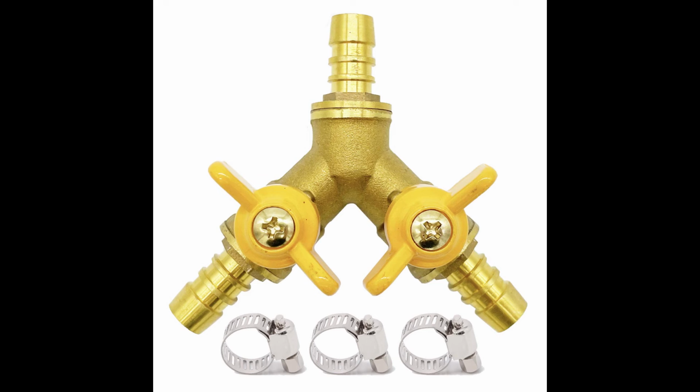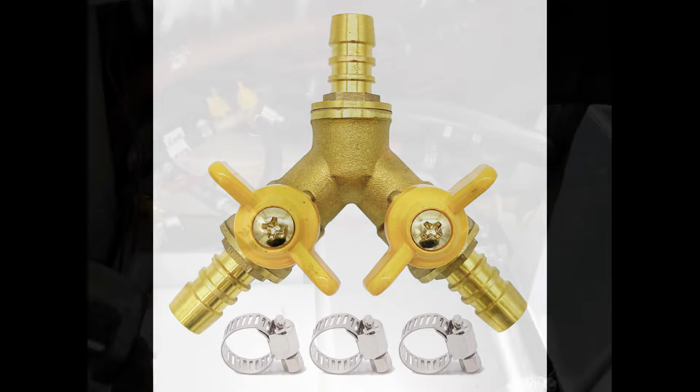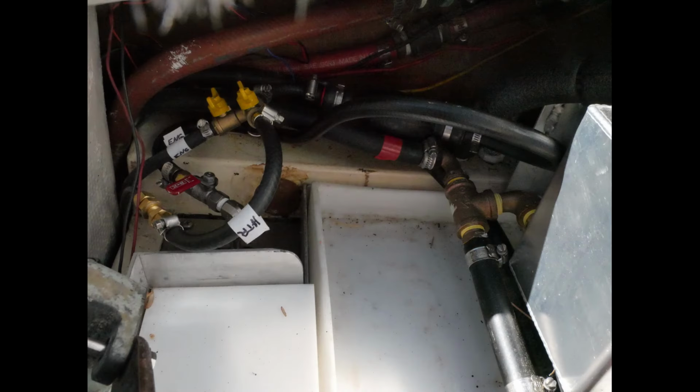I will only open the heater line when I'm filling the heater tank, so as not to lose my prime on the engine. Upstream of the Y, I have a squeeze bulb that can prime either the line going to the fuel pump on the heater tank or the engine.